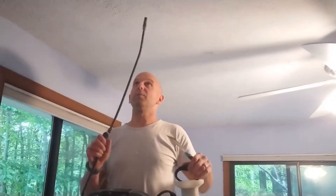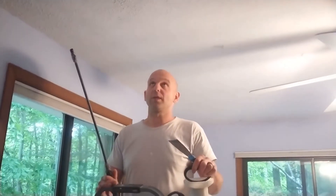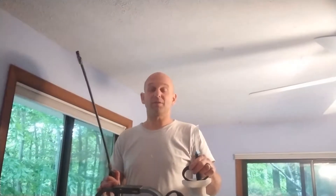It's a simple process of just softening the plaster that's up there, letting it sit for a few minutes. And sometimes if it's a really stubborn surface, I might spray it down, let it sit for five minutes, spray it down again and then start working on it. But that's totally up to you. Spraying it makes a big difference.